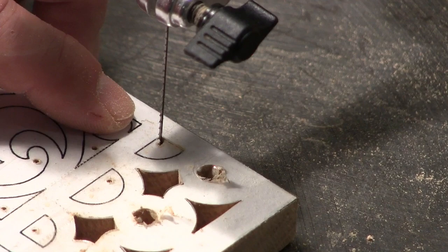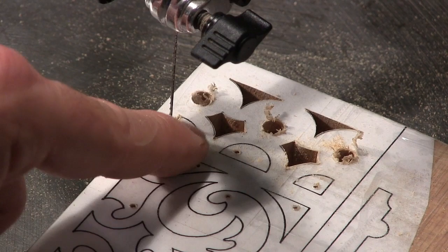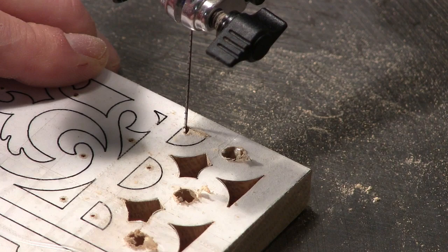Now when you have straight lines like this it's really important that they be good and straight, because if you look at the overall picture you can see that they need to match and they need to be straight. The best way to do that, especially if you're new starting out, is to take your time and just move the project in a little bit, and if that blade looks like it's going to wander take your foot off of your pedal, square it back up, and then take off again.